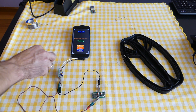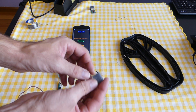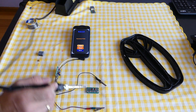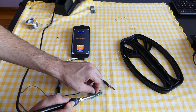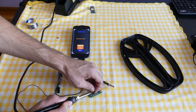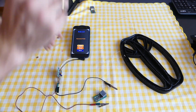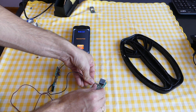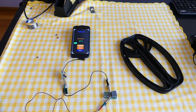The reading is 7600 Hertz — still too much. I need to remove these small capacitors and put in one bigger capacitor, 0.33 microfarad. After that, I may still need to add a small capacitor, but right now the small ones can't help me since 7600 Hertz is too far from the target of 5400 Hertz. Now we test with the new capacitor and get 6300 Hertz, so I need to add a small capacitor to lower the frequency further.